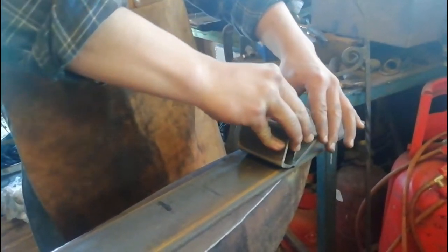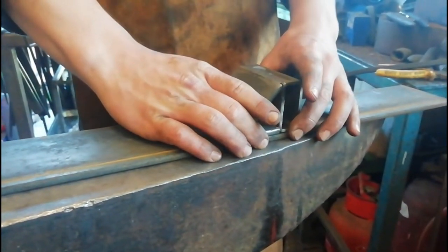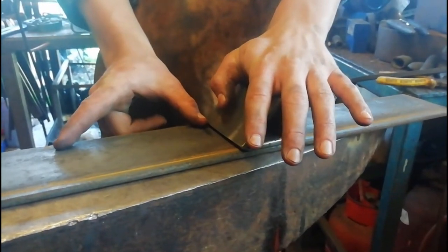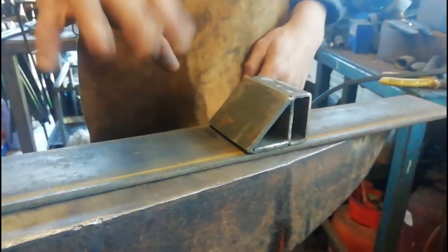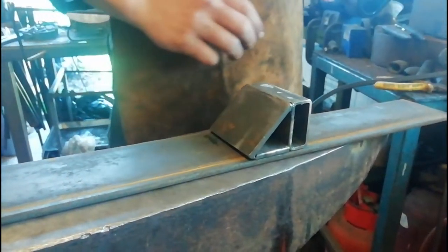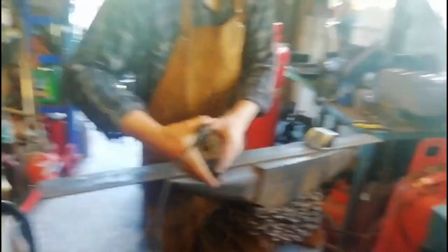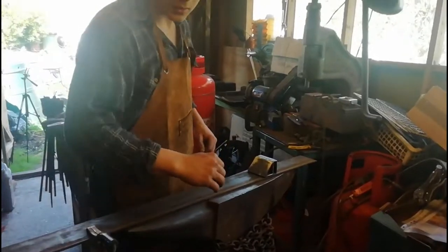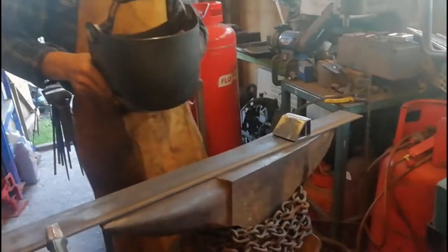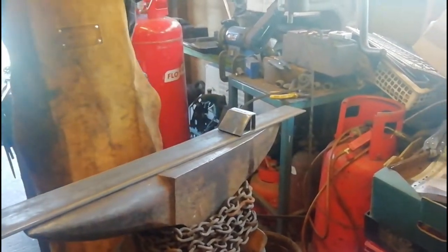And we roll this over. When this comes over we should have about 5 inches of extra metal here which we can just bolt into each other, so it's nice and sturdy in there. So all we're going to do now — now it's in place — we're going to use the welder, and we are going to weld on the outside, so along here and along there, we're going to weld it on.